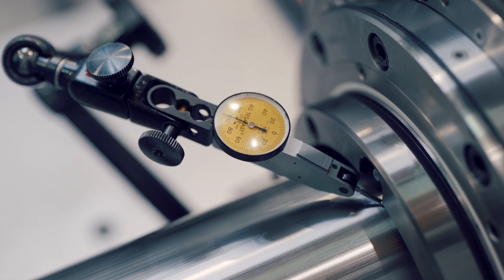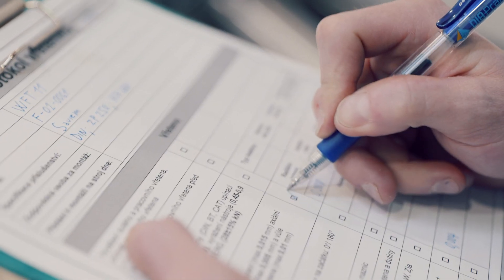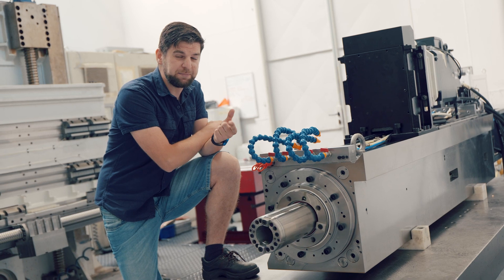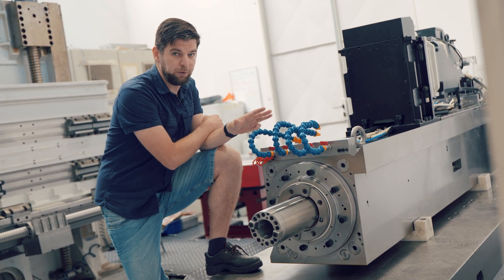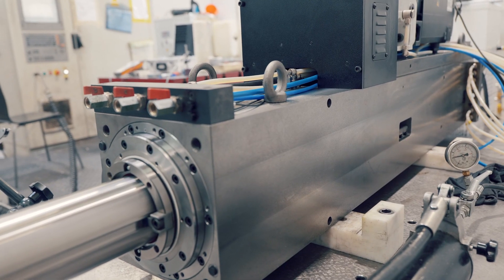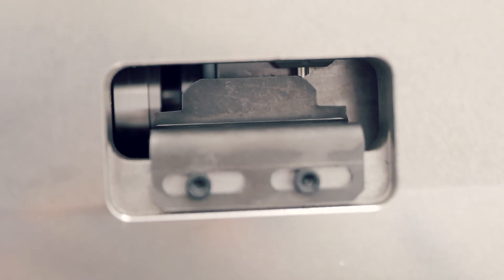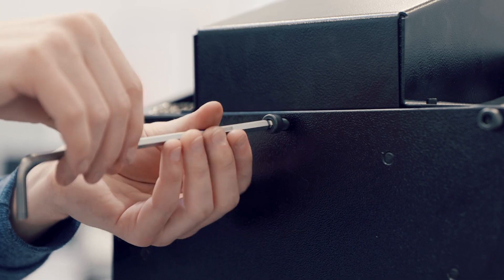Let's talk a bit more about a boring spindle above the W-axis. It is also necessary to check the proper function, placement and setting of the hardware and switch for boring spindle travel. Should the software switch fail and the spindle exceed a certain limit position, this hardware sensor automatically notices that and the headstock stops.